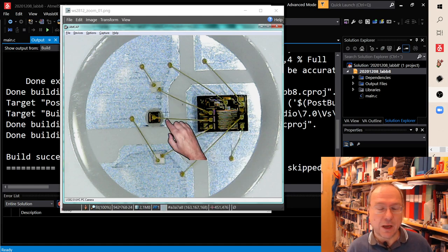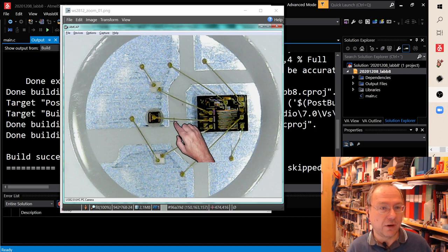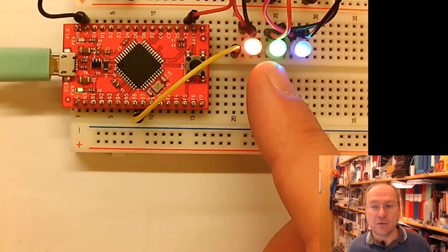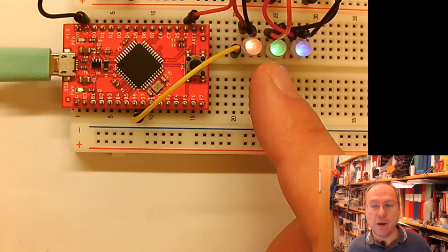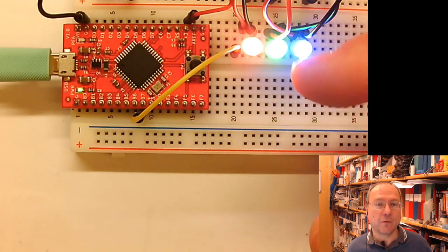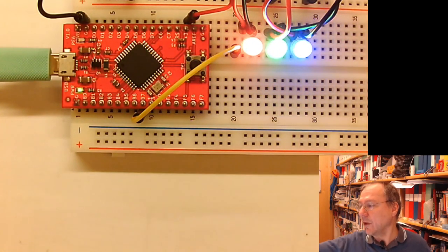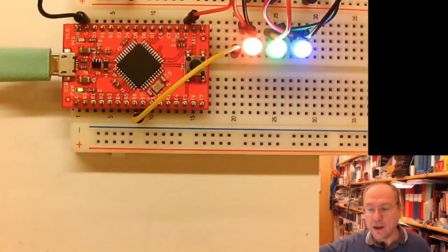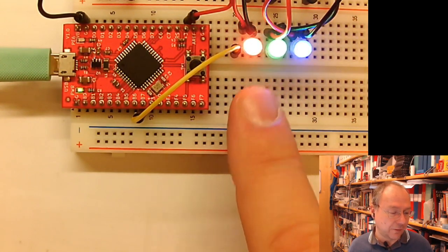And the PWM frequency for these is above 400 Hertz, it says in the data sheet. That's why it looks as if they were continuously dimming. But actually, as you might see from the interference pattern on the camera, there's some striping going on in this direction here. And this is again because of some interference between the shutter time of the camera and the actual switching on and off of the individual LEDs here.